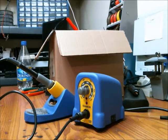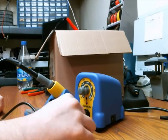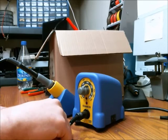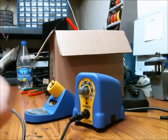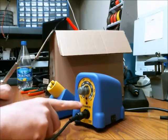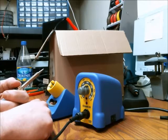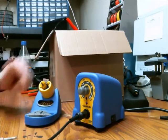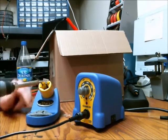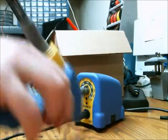Here's the seventh soldering iron I've owned. It's a Hakko FX-888. I've heard they've discontinued this, so I'd recommend buying one as soon as possible. They're only $80 plus shipping, so it's not too expensive. I really think this is a great iron. You have a nice handled iron, and you can take out the tip and replace it with whatever kind you need. You can go up to 900 degrees Fahrenheit or 480 Celsius, which will handle lead-free and other work without a problem. It also has a really nice stand that's heavy so it won't move on you, a copper cleaning mesh, and a cleaning sponge. It's a really great iron and I definitely recommend buying one before they're no longer available.